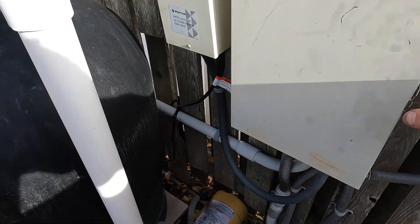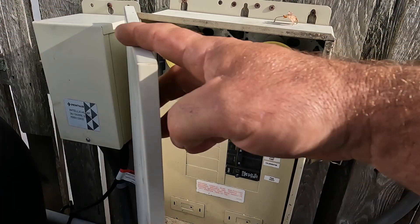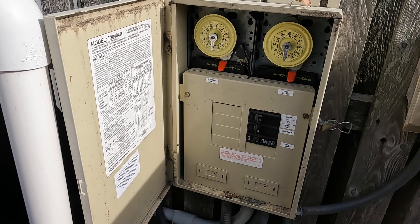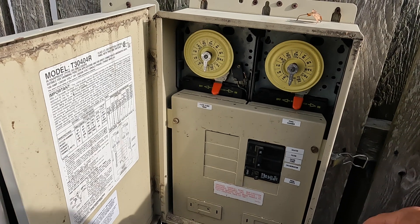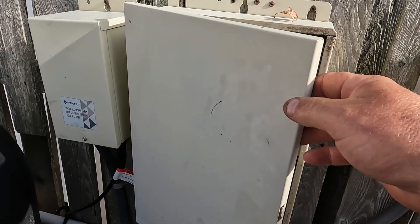In there there are a couple of timers, a couple of circuits to work those circuits - the timers, everything's off. Just wanted to point out one thing with that control box: it's got the circuit breakers and two timers. You may have noticed there's no GFCI protection in there, but there is a GFCI right beside that panel. The reason is that's a double-pole motor, and years ago when this pool was installed it wasn't required. Nowadays, GFCI is required whether it's 120 volts or 240 volts, but if it's existing and been working like that for years, we leave it until there's an issue.